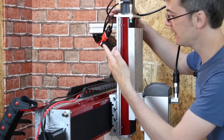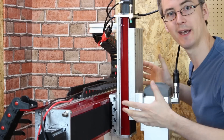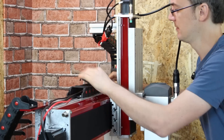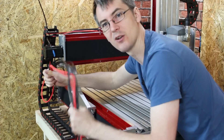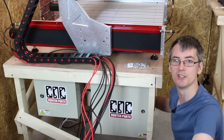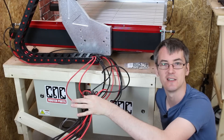I'm starting to cable everything in — running all the cables for the end switches, motors, and the main spindle motor through the cable trays. All those cables come along the upper cable track and into the lower one, then down to the control box. I've mounted the two control boxes on a piece of wood attached to the bench, so all the cables run down neatly and tidily.